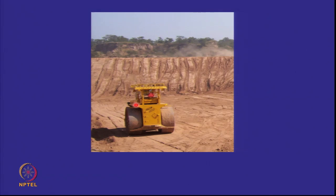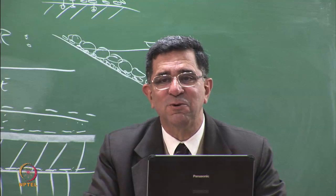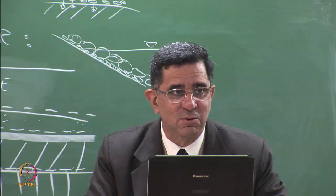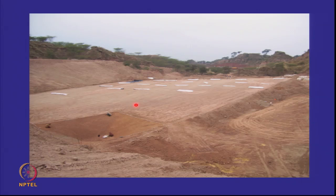This is not the roller you should be using. What type of rollers do you use in clays? Oh, great, wonderful. So sheep's foot rollers are the ones which have to be used, not road rollers or smooth steel drum rollers. And I will come to that why. Now you have rolled it and you have made a sump here.